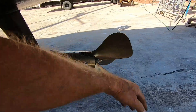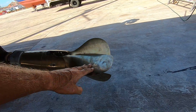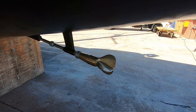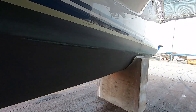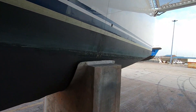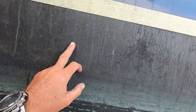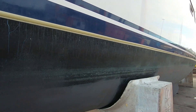And obviously as you're going forward sailing, it just folds up so you've got minimal resistance. Crazy design — works really well. I've got the hull keyed mostly; just got to sand the top sections now, getting rid of all the cracks from the paint drying from being out of the water for such a long time. This side has started to flake. Some serious cracking on the anti-foul due to being exposed above water.